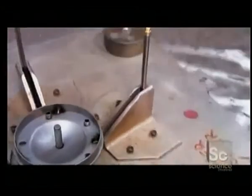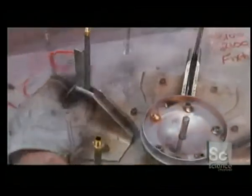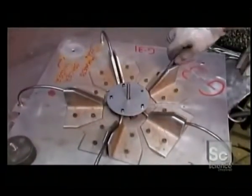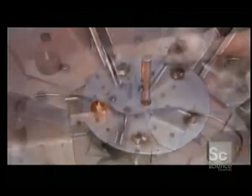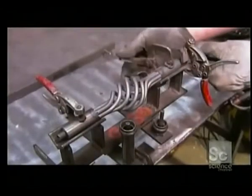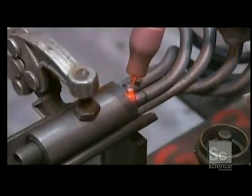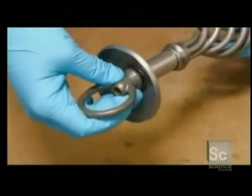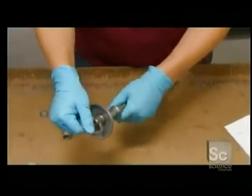Using a mounting fixture, a worker places the polished upper arms into what's called a distributor. He welds the arms to the distributor, which both supports them and gives them proper alignment. He welds the lower arms to another distributor. Next, he welds metal tubing onto each end of the twist basket, making it possible to connect all the decorative components.